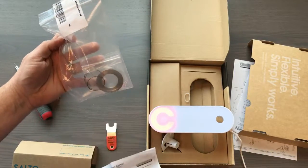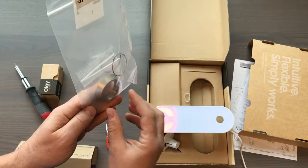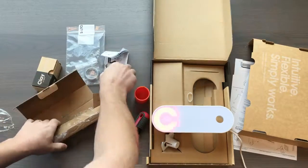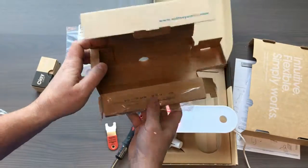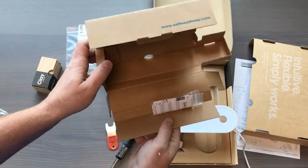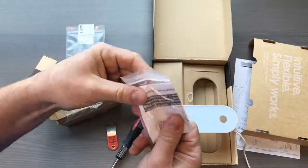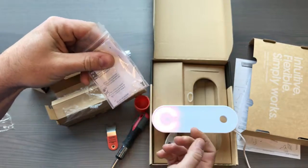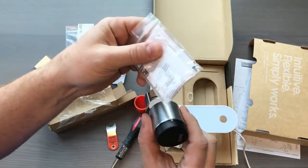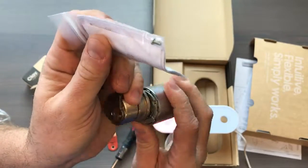This right here is a beauty ring — it makes it look nice on the outside of the door, because otherwise it will stick off a little ways. Very importantly, when you open this box all the way up, in the very bottom there is a tiny set screw. That set screw is what's going to keep people from being able to come up and just take this off, because the set screw goes right here.